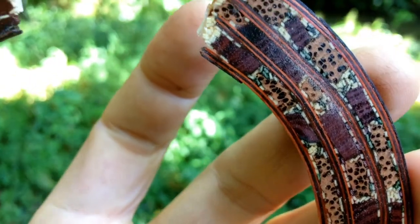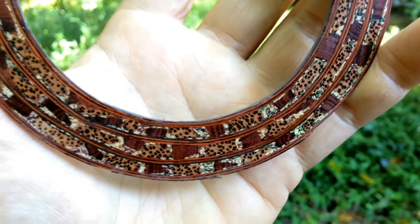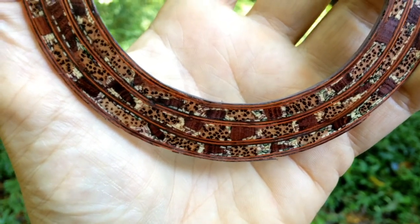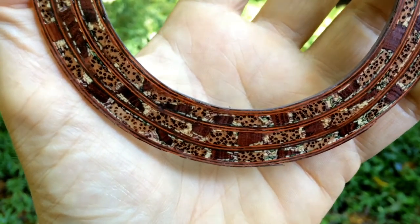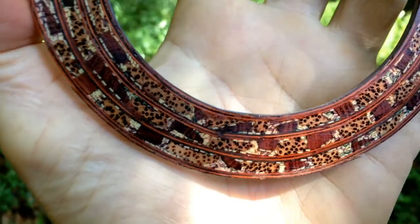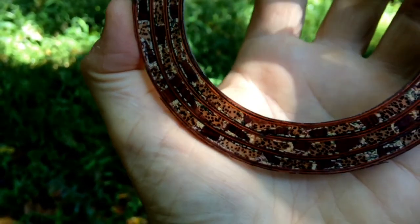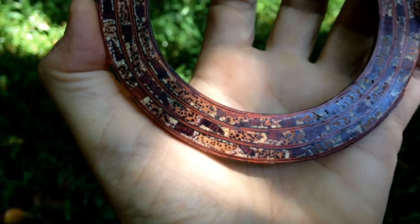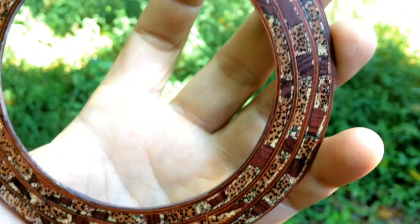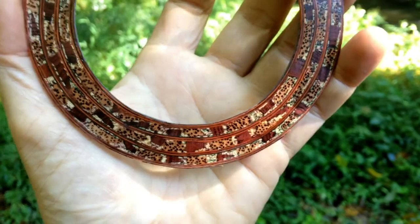On this one, what I did — sometimes I'll use white glue and glue the little bits individually, maybe put some glue in a space and stuff them in. But in this case, what I did was put all the bits in dry, and then after that added some high viscosity CA glue — otherwise known as crazy glue — which just sort of sucks down into the holes. It works quite well for something like that.